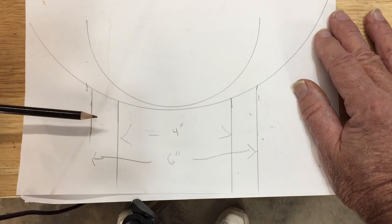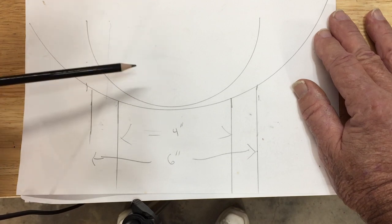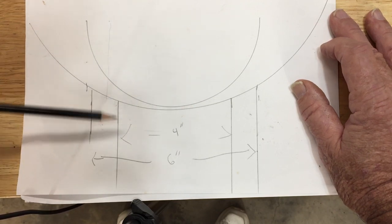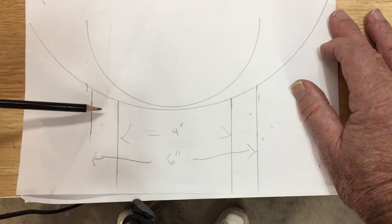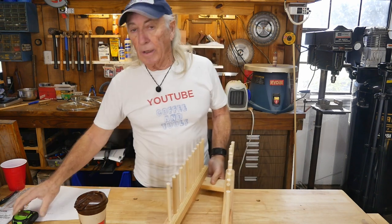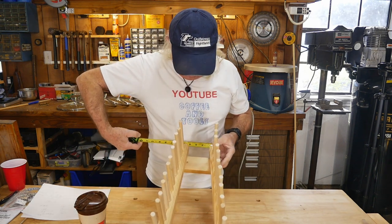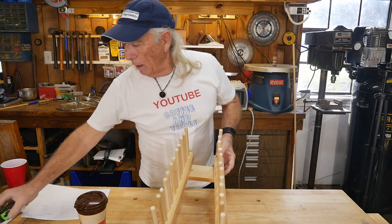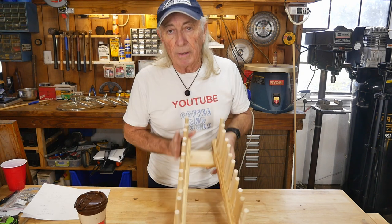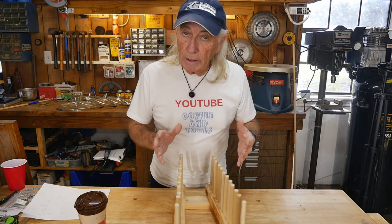I started with 21 inches for length, but all of this is determined by your lids. Maybe your wife has a collection and you'll have to change dimensions — that's why I'm showing you this method. Take the biggest lid and smallest lid and lay it out like this. From that paper diagram I determined that the inside spacing had to be about six inches on one end, narrowing down to three and a quarter on the other, which is why you do the paper thing first.